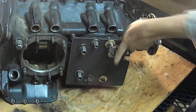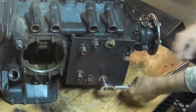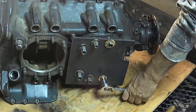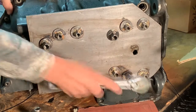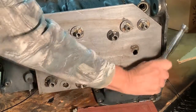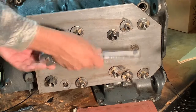There are excess washers on the left, so I'm going to start trying to tighten here, just as before in the other films. Hopefully we'll see something begin to open up. It's going to be necessary to do this in a symmetrical way — that's the challenge. Get the right wrench on the right socket, then you've got to criss-cross, otherwise you're kind of wasting your time and you get it distorted. These aren't as tight as they needed to be, and one of my nuts even fell off there.